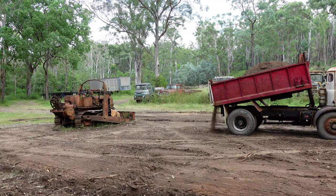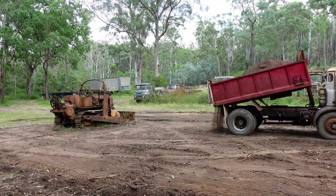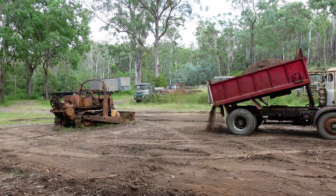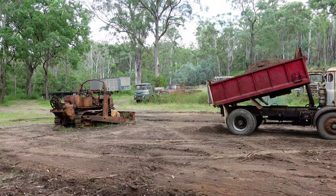So you'll notice here that the hoist won't lift it. It's loaded, I don't know, it's not too heavy I wouldn't think, but it's a decent hoist and a decent pump, but I had to shake the load out to get it further back so it would lift it. And in between stages of the hoist, each stage was getting jammed too. It hit the first, second stage was about to come out, then the hoist had stopped. So I eventually started loading it against the tailgate,